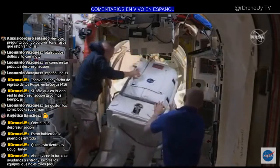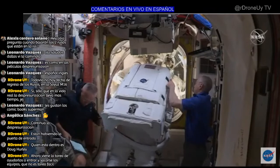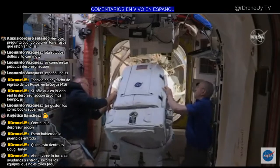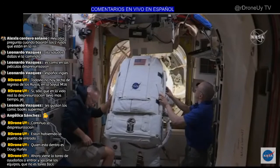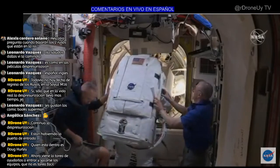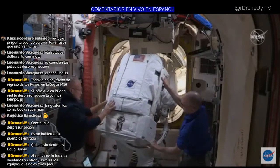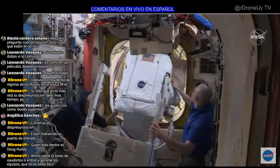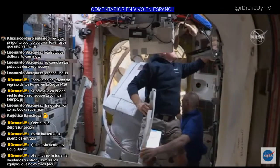After installing RITs and routing some associated cables, Cassidy moved on to remove the 1A H fixture. The H fixtures were used for ground processing solar arrays prior to launch, but needed to be removed for future power upgrades. The first attempt to remove these was on the July 1st spacewalk. With no luck on that day, the astronauts returned today and were able to more easily release those fixtures. As Cassidy removed the 1A H fixture, Bob Behnken worked to clean the integrated electronics assembly area after the last three spacewalks in that location. He then moved on to remove the 3B H fixture, another one of those necessary for removal for future power system upgrades.